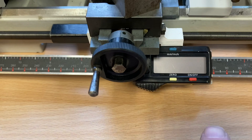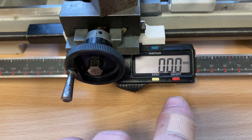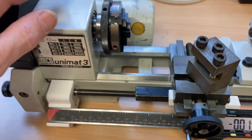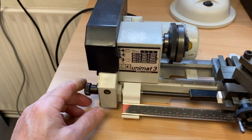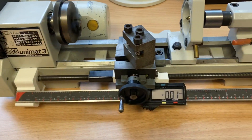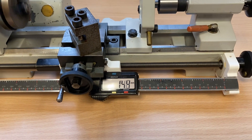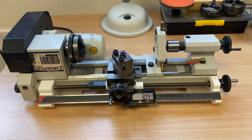So let's see this thing in action. Turn the caliper — oh excuse me — now DRO on. Zero it out. Let's turn the lathe on. We'll engage power feed. And look at that — we have digital readout in the x-axis. Awesome.